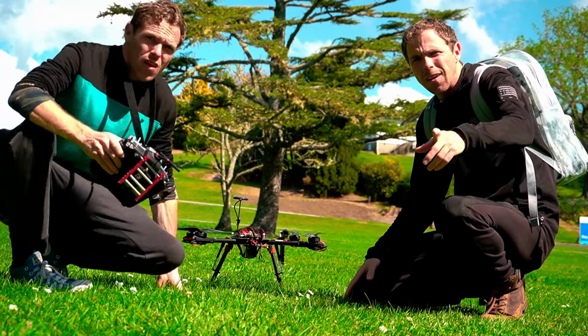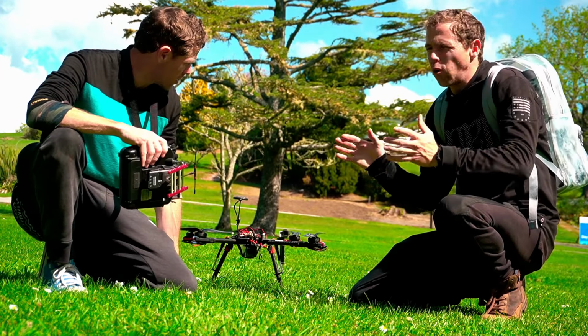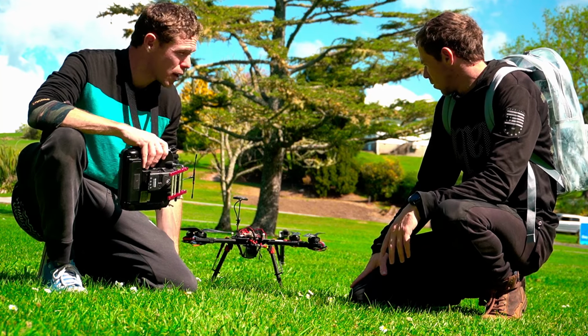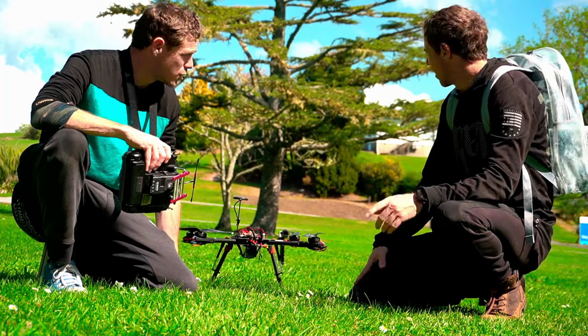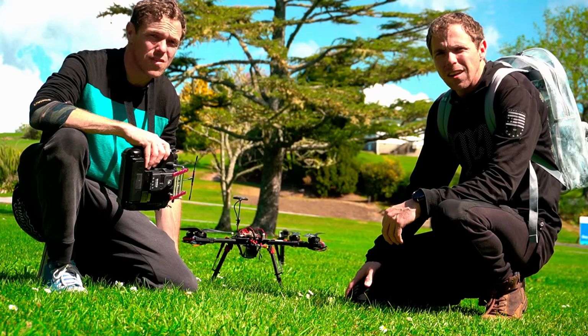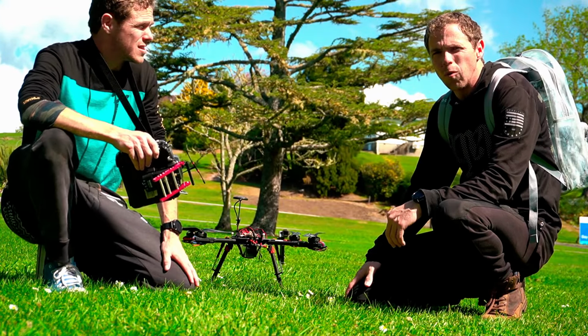Okay, so what are we doing? What we're doing back at the little park is an Alt Hold test, really, ultimately. So basically sit up in the air, hold, and then flick it into Alt Hold if it's happy. Leave it for 30 seconds, come down, land, save it, and check it on the computer. Yes, that's what we would be doing.